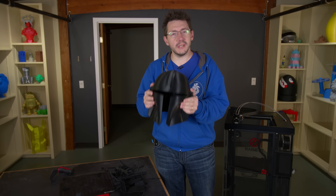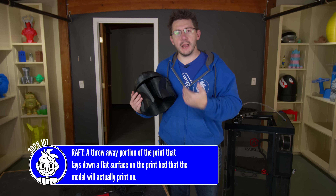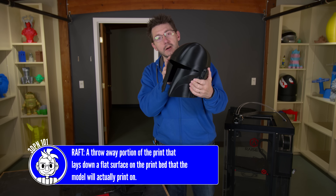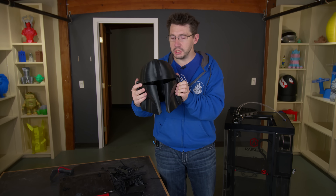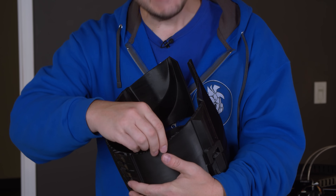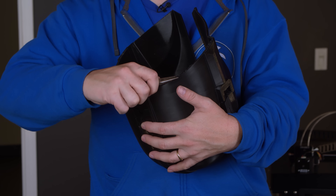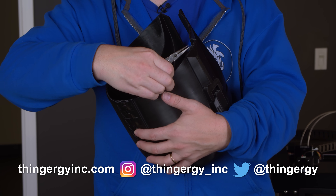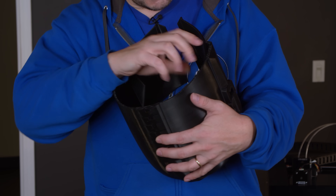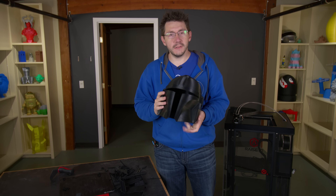The model was not touching the build plate — we used a raft. I like to consider it as insurance for the print. The entire perimeter of this model was sitting on support structures that the machine generated. So it printed just like this, and that's why we still see some dense support layers that didn't break off. I do have needle nose pliers, and Frank from Thingergy gave me a tip that a curved X-Acto knife is great to get those off as well. The big test — literally it's a big test — is to see whether it fits on my big head.